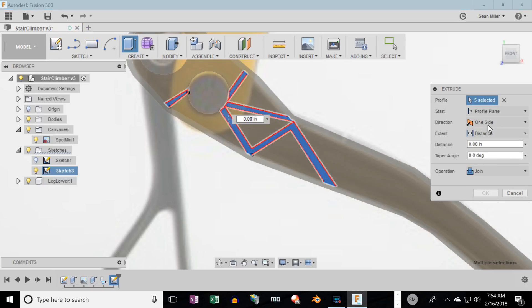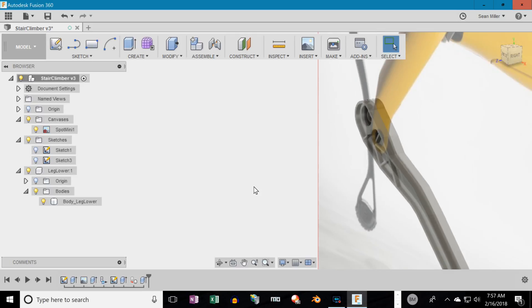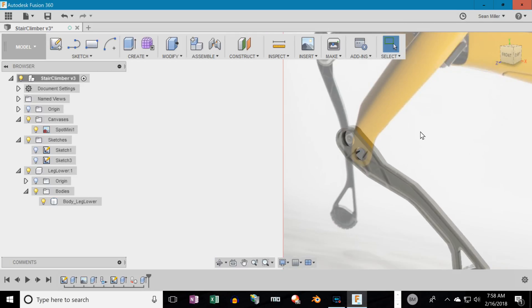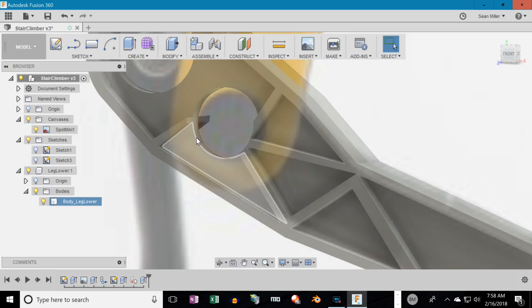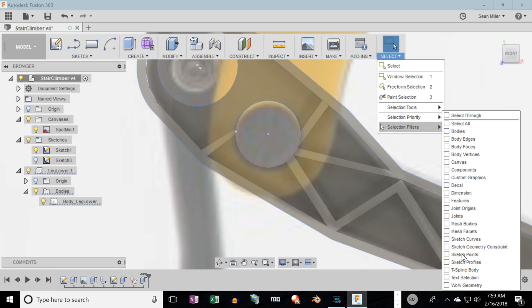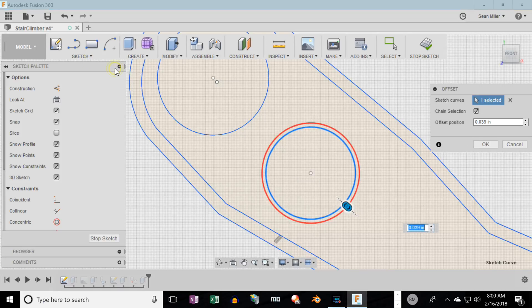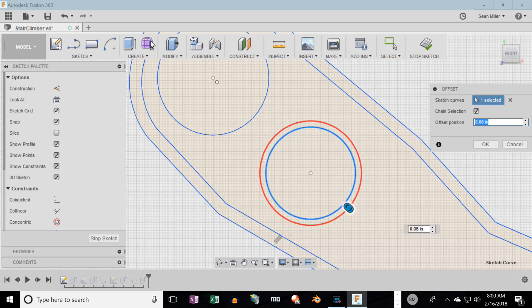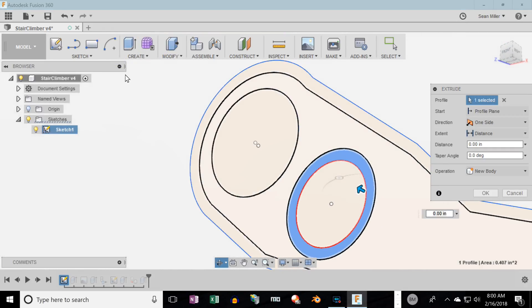The webbing has come together. It's got about an eighth of an inch core to it, a quarter of an inch center, and then it comes out about a half inch on each side. Now these holes — that's where bearings will be pressed in. So I'm going to go ahead and draw those. I've got to beef up a support so the bearing can seat into that. Right now I'm changing my selection filter so it'll only select that circle — if I didn't do that it'd keep wanting to select the body. I just want to select the circle and put an offset to it about an eighth of an inch — an eighth of an inch is 0.125. There we go and we'll extrude that out by hitting the E key and dragging it out.